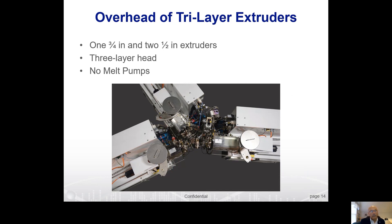Because of their small size and platform, compact modular extruders nest together very well in multiple-extruder configurations. A popular tri-layer configuration uses a three-quarter inch extruder and two half-inch extruders. We also do many setups with a one-inch extruder and two three-quarter inch extruders. With bigger bases and larger extruders they tend to get in the way, but these modular extruders work very well for tight multi-extruder arrangements.